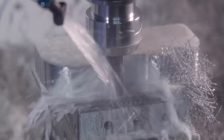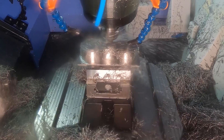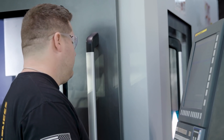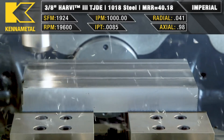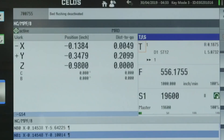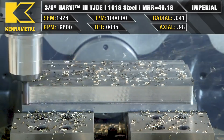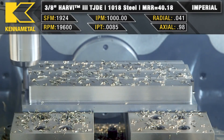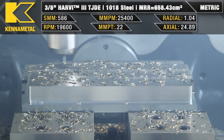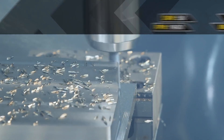Not all tools are created equal. I've seen an end mill from one manufacturer last for 10 minutes in titanium, and an end mill from another manufacturer last for three hours with the same feeds and speeds. You might be using a 15-flute Kennametal end mill in titanium like Jesse did in his swarf milling video recently, and instead of running at 200 SFM, you're running at 600 SFM. On some machines meant for super fast feeding or mold making, lower radial engagement and full axial depth can get you a better MRR. Titan did a video where he was feeding in steel at 1,000 inches a minute and achieved 40 cubic inches per minute material removal rate with a three-eighths end mill. High performance milling like this will usually outperform a high feed mill or any inserted cutter, and it increases tool life because you get less deflection due to the lighter stepover, and you spread the wear across the entire flute length instead of only using the bottom portion.